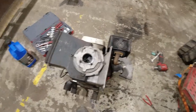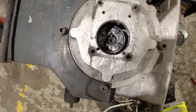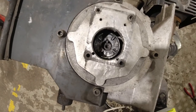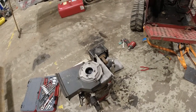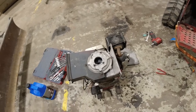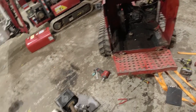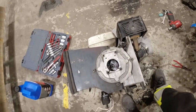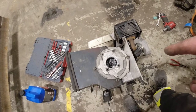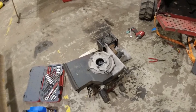The gas is drained out and I think I found the point of failure - the bolt keeping this in place is missing. I don't understand how it can disappear because these couplings are connected together. Probably someone forgot to install it when we changed the engine during the winter or last fall. That's probably the main reason for this failing - this one came loose and they got too close together, eating off the ears and the rubber and everything.